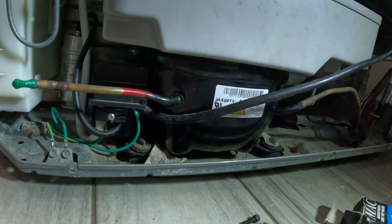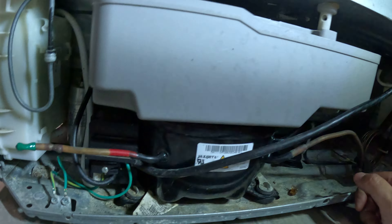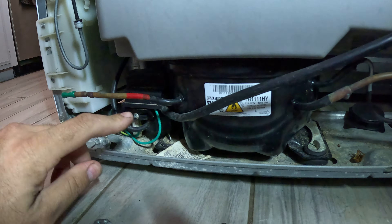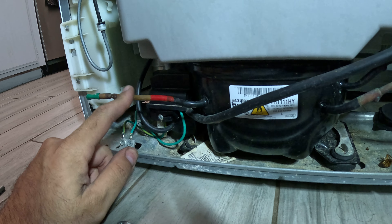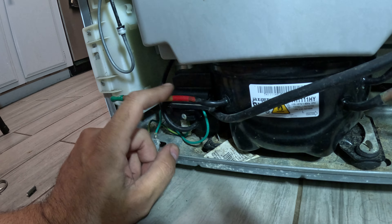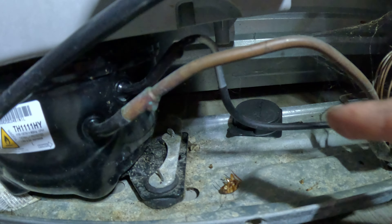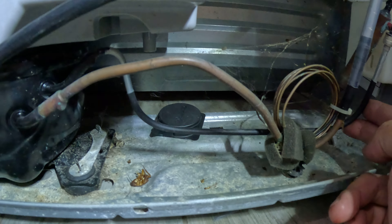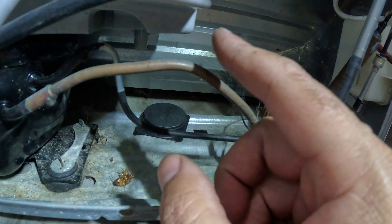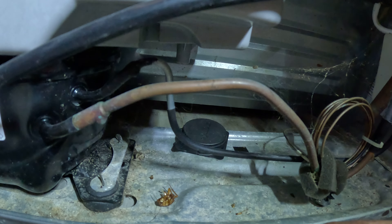You can actually pick two areas to install this valve — it has to be your suction side. You could put the valve right here, or you could put it right here in this area — this is your suction area as well. This little stubby right here is a process area from the manufacturer, so you can put it on this part if your compressor has this type of piping. You never want to recharge on your discharge — the discharge is a small little steel piping. You want to add it on the copper suction line, and when you touch it, it's going to be a little bit cold — that's another way to tell which is your suction line.